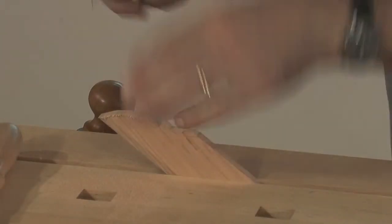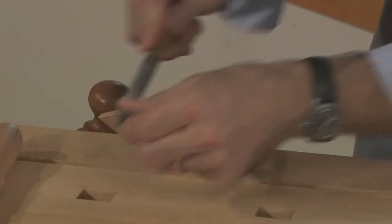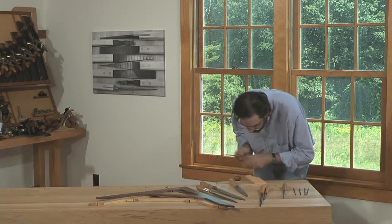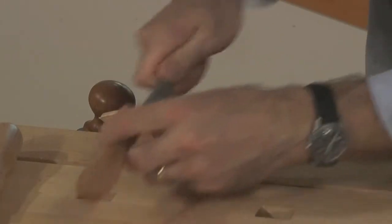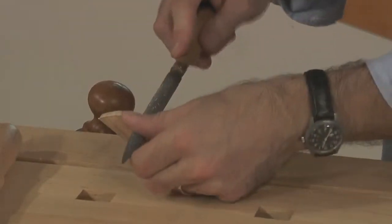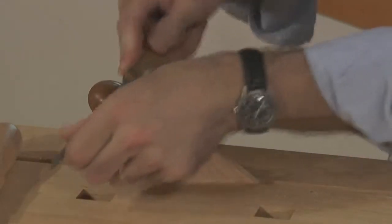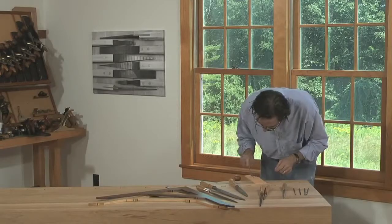Now this is the modeler's rasp. While it's generally designed for finishing, it can also be used for removing some material. I have a little material to remove there, especially here by the fillet. I can use more downward pressure and that will actually remove material, so you don't always have to switch back to your cabinet rasp to fix that. This looks good on this side and looks square across, so I suspect my layout lines are a little bit off — we'll come back and fix that.